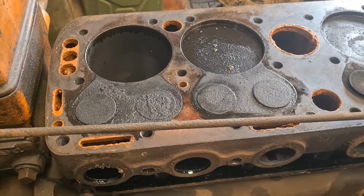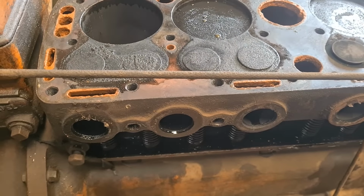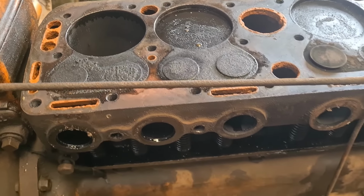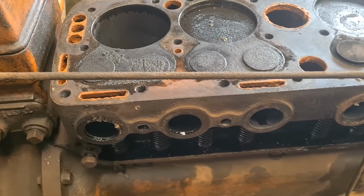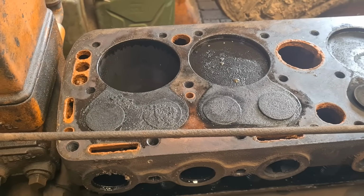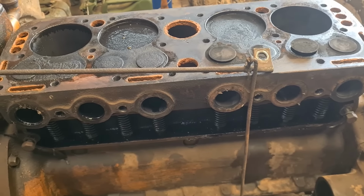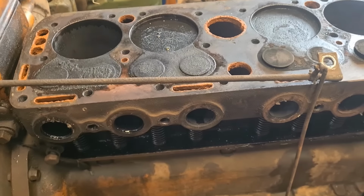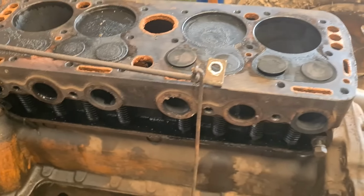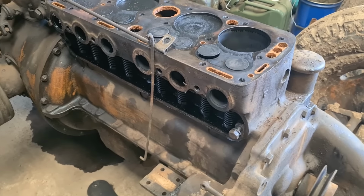Whatever. But anyway, we'll have it out and put the other engine in, and then we'll have this one to bits and have a look at her, service the valves, grind them in, and make sure all the clearances come good, and then look at the rings and see what's going on with the rings, and if there's any shims in there we'll take them out and shut the big ends up and stuff should they need it. It might be they're rattling on the little ends, but so we just need to take it all to bits and have a look, sort it out, put it back together, and have another go.